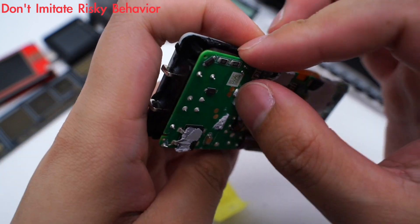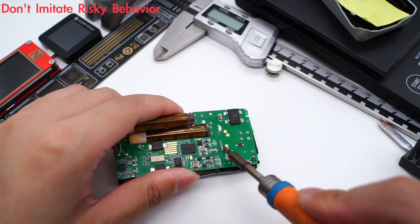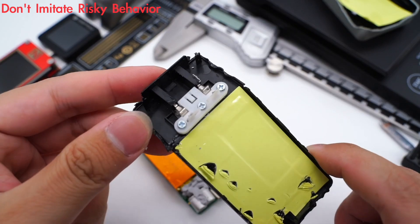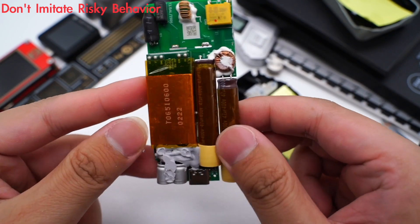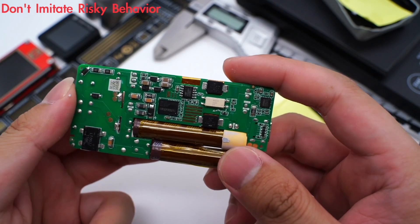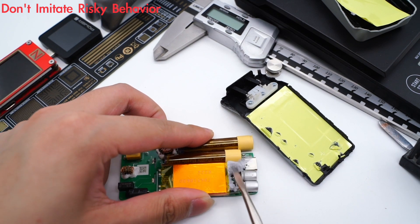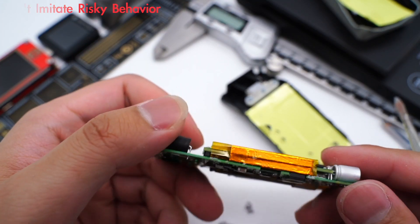Here are the input prongs. Remove them from the PCB. A layer of yellow insulating tape is on the other side, and the prongs are fixed by screws. The planar transformer is on the front. Those two cylinders are electrolytic capacitors from Yongming. Here is the output solid capacitor, which is placed horizontally to reduce the thickness. All those special components and layouts make this charger so thin.